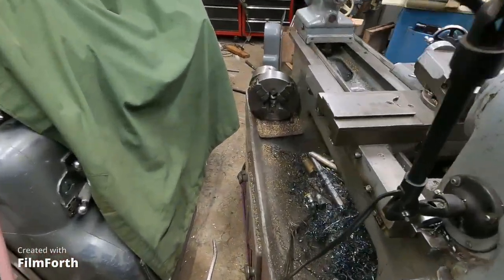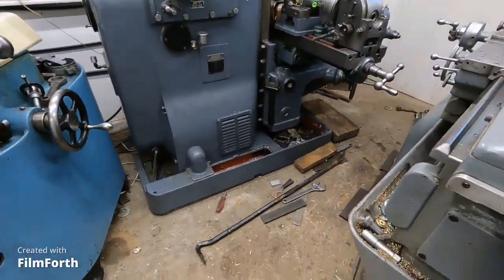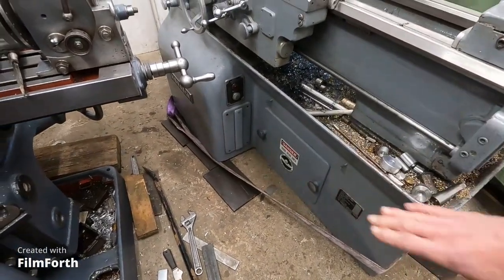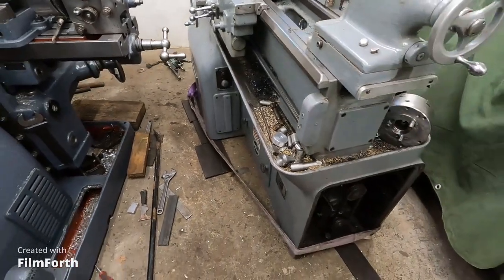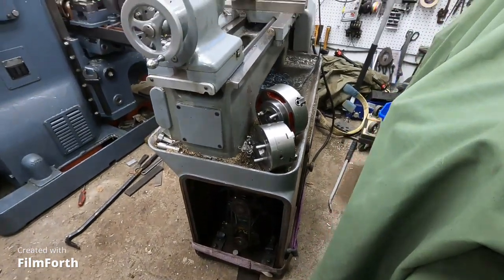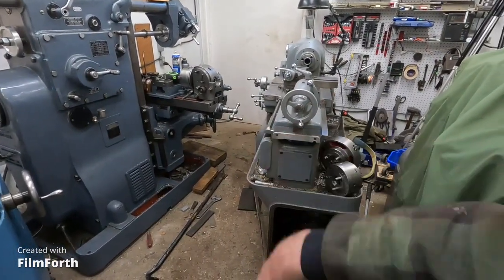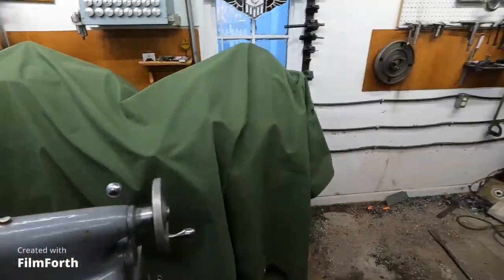It's kind of a tight fit. Now it's going pretty fast — you see the plates down there, I can just line them up and pull the thing the length of that chain before I have to reset. Got a long piece of strap under the tail here, so now I got to slide it over just a little bit, bar it over and pull it, then get it around the mill here. Once this is out it's going to be a lot easier.